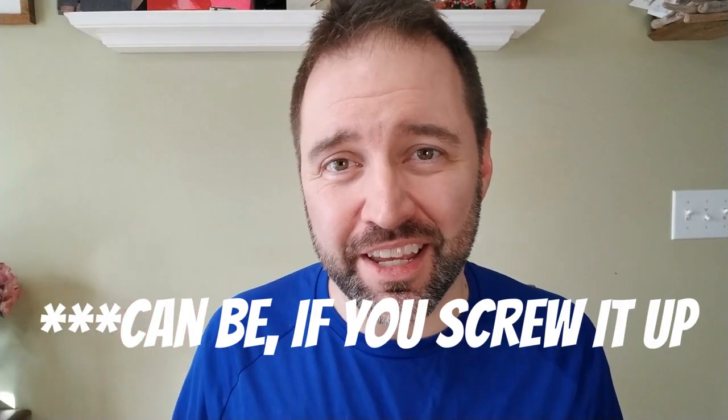If yours works, you are good to go — there's no need to watch the rest of this video. But if you notice that yours is over traveling, you're in the right place. This 1849 pocket model, I got it right from the factory. If I pulled it back slowly, everything was perfect — no problems whatsoever. But if I pulled it back quickly, every single time it would over travel by nearly a quarter inch. It was pretty horrendous.